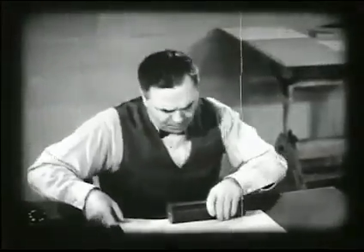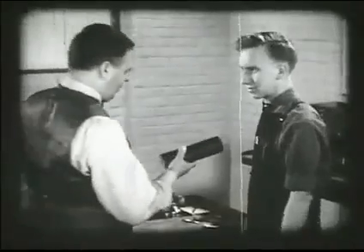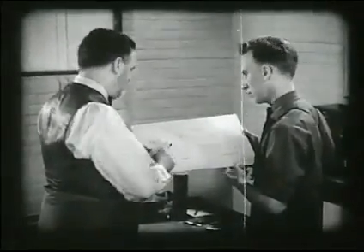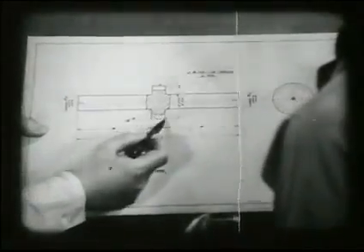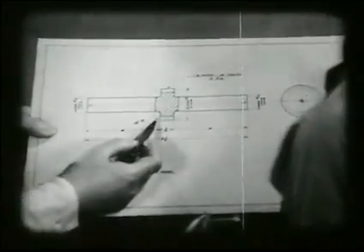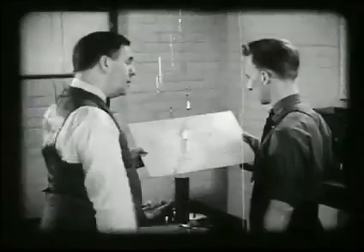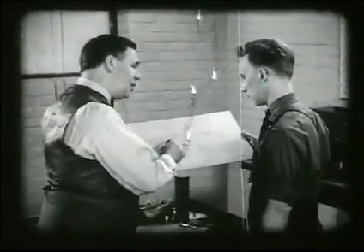The job usually starts as a piece of rough stock and a drawing on the shop foreman's desk. Bring the collar diameter down to two and one quarter inches. The shaft diameter is down to one inch. The collar width is three quarters of an inch. The shafts are four inches long from each collar face. The drawing allows a leeway of minus two thousandths of an inch from the dimensions given — that's the tolerance of this job. Finish up the fillet where the collar joins the shaft.